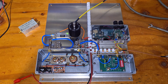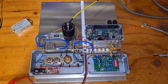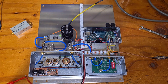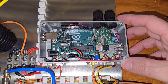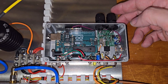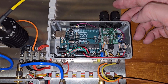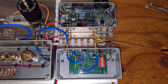Here's the beacon in its current implementation. It's mounted on an aluminum panel which will drop into a large box for mounting the whole thing up on a tower eventually. Up here we have the Arduino beacon keyer that generates the Morse code messages. These unused cable glands are for wires to feed in from temperature sensors — I'm interested in having the internal and external temperature at the beacon be part of the Morse code message, but I haven't gotten to adding those sensors yet.